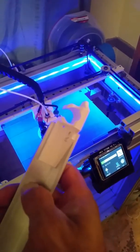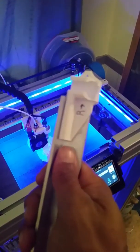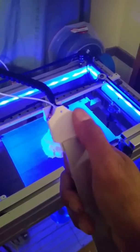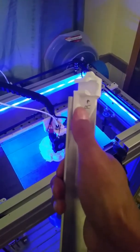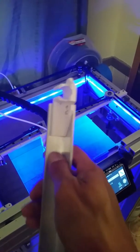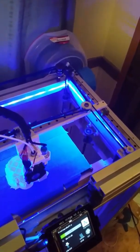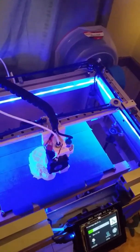I've got super glue on there with Loctite — it's really, really solid. I'm pushing as hard as I possibly can and it's not cracking or popping at all. I sanded it and used my Dremel to rough up the aluminum so the super glue has something to hold on to. Like I said, this is a quick fix to hold me over until I invest in some more linear rails.